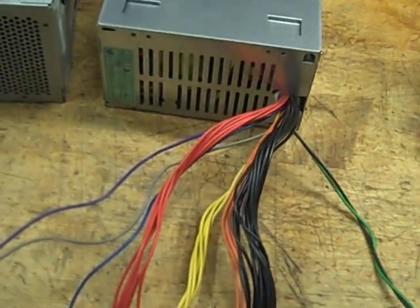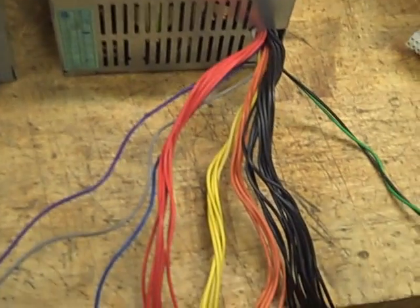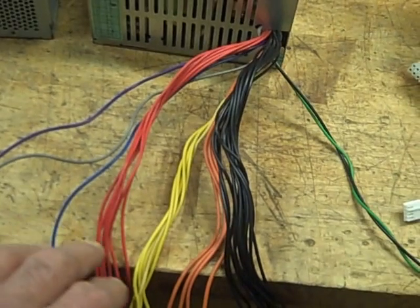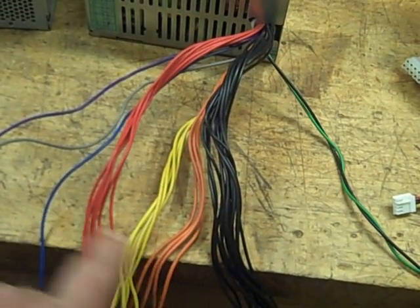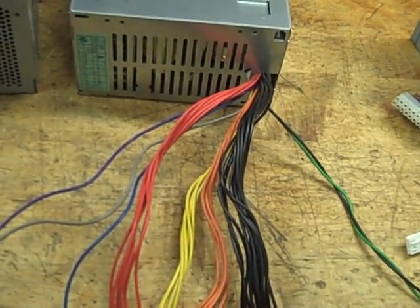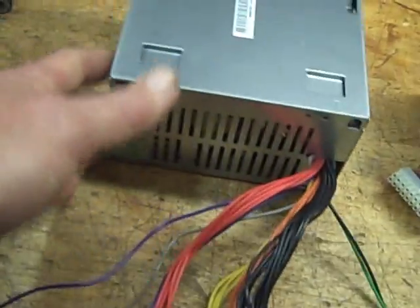This 12 volt output is 12.0, so it's not good enough to charge a battery. To charge a battery you need something like 15 volts. So you could charge a battery between the plus 3 and the minus 12, but you're limited on how much current — you'd get maybe 500 milliamps going into the battery. So it's not a heavy duty charger, but it can be done.